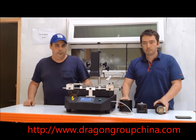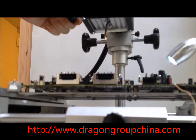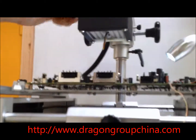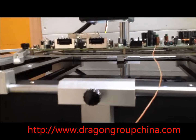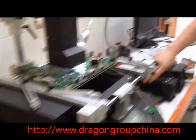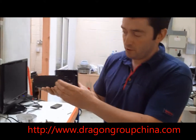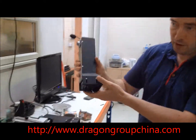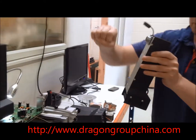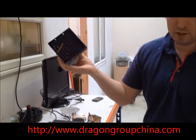But essentially this is the Bird 8888. We're going to be doing a chip lift here with the infrared tubes. This is an Xbox 360 GPU that will be taken off. With the Bird 8888 you get different attachments. You've got the standard infrared that just clips on and plugs into the connector.